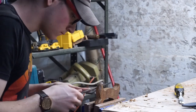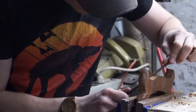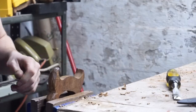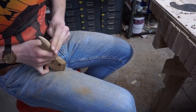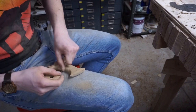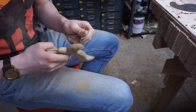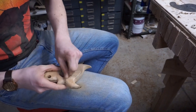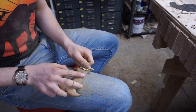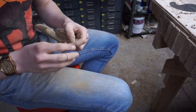The handle shape is really starting to take shape, and now I'm just doing some light refining with this round rasp file. I need to get some more files — it's a good investment, I think. Moving on to the dreaded hand sanding: I spent about an hour and a half sanding with 100 grit to get rid of the scratches and tool marks from the file. In hindsight, using the file was not a good idea — it added a lot of time onto the sanding — but I was able to get a nice finish with the hand sanding.